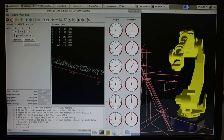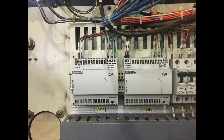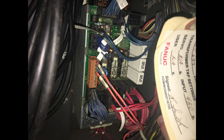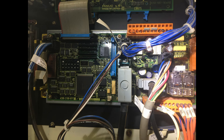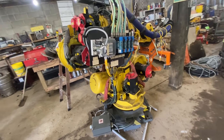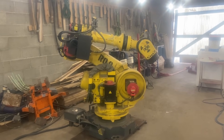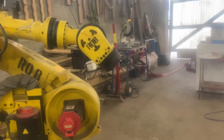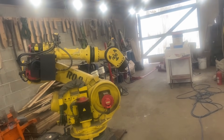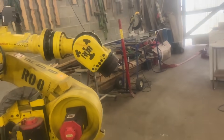The main goal of this entire project was to get the robot able to run G-code. Originally, the plan was to use the original FANUC controller, then write a post processor for Fusion 360 that would output program files that the robot could read directly. So I went through all the effort to get the original controller running — I installed a 3-phase converter and transformer so the controller could have the 480 volt 3-phase it needed. I spent a couple days fixing some error messages on the controller, then was ready to test the robot. All the motors worked, no errors, everything appeared to be working. I remastered the robot, which is when you reset the zero position of all the joints, and tried doing some linear moves. This is where I found one of the biggest issues.